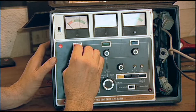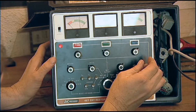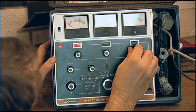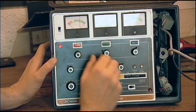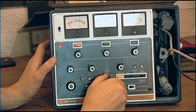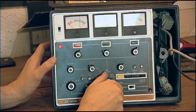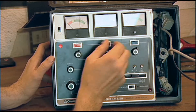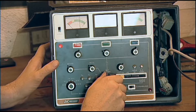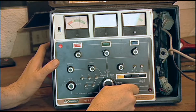I set my cutoff to one division. Oh my gosh — the red's showing pretty dead. Going to test. It's all in the bad range, all in the bad. This tube probably has about 33 years of continuous service and it's never had a rejuvenation. We're definitely going to rejuvenate this.